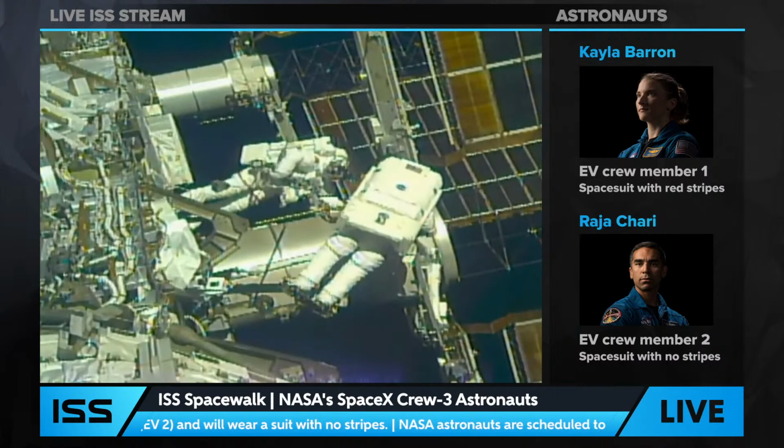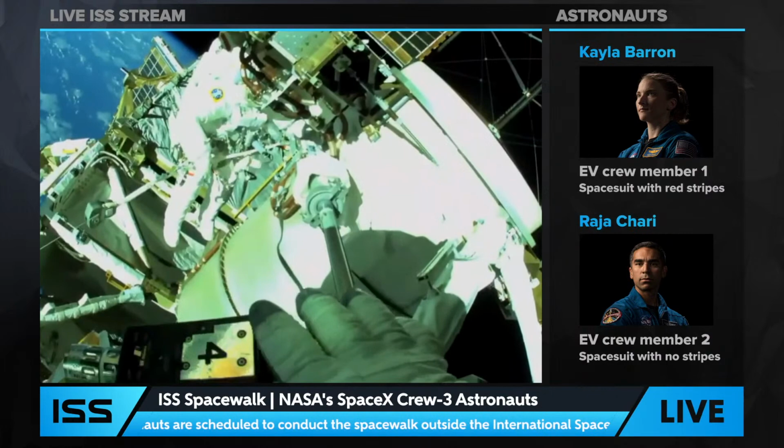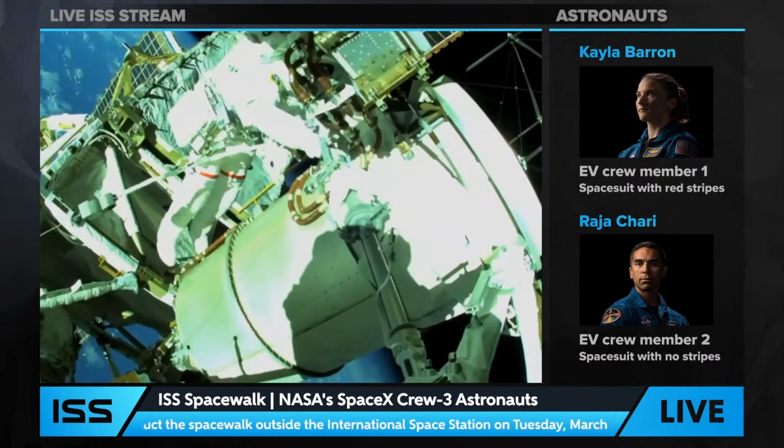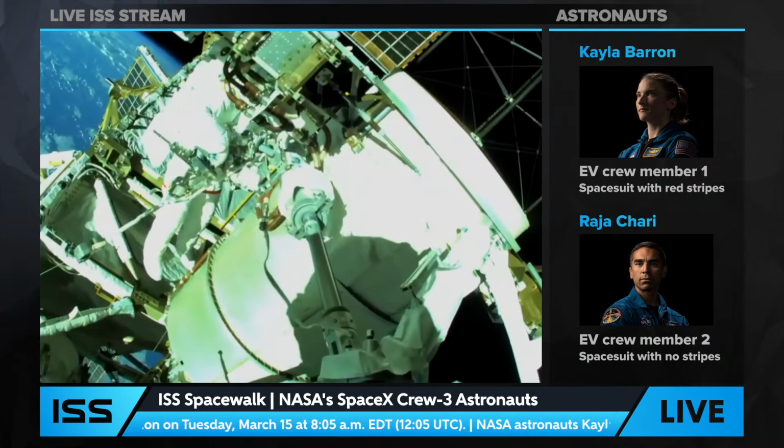Yeah, M28 had 6.7 turns on the PGT. Good green light, 11.8. 6.7, copy, black line flush, 6.7 after your two hand start for 8.7 total turns, black line flush on M28. Roger, you can stow your PGT, and Kayla, those same PGT settings we'll use to torque M1 through M4.